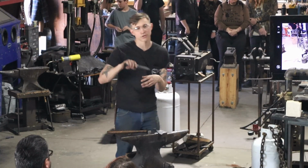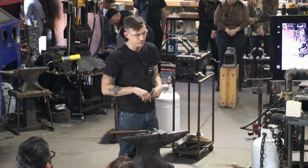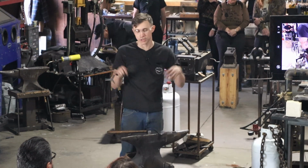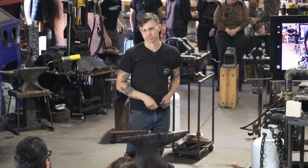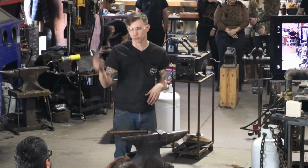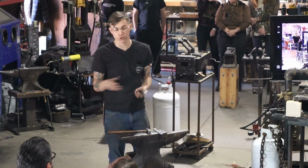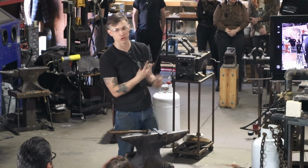And so the last thing I'll say is about your abrasives. You can jump from 60 to 220. You can do it. If you're going to make one knife, you probably should. If you've got a good fresh 220, you can probably get by, if it's not an enormous knife. But if you use more grits, you'll use less belts. If you go 36, 60, 120, 220, 400, whatever, or maybe even more, then each one of those belts will wear out slower. And so you'll start with 4 belts, but you'll use those 4 belts longer than the 2 belts that you tried to jump.